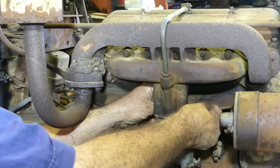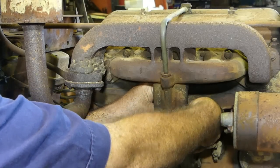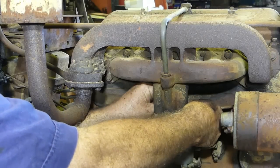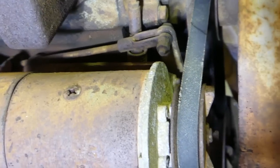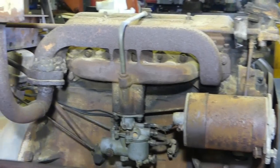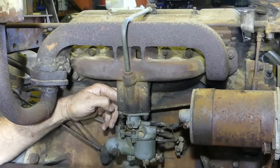Now the governor rod here — same thing, it's got a split pin all curled one way. I can't actually see what I'm doing here. There's normally a pin at the front here too, but in this instance they've put a nut and a bolt. I'll sneak off for a second and get a set of side cutters to extract that pin — it's all been doubled up.